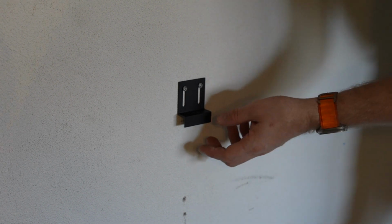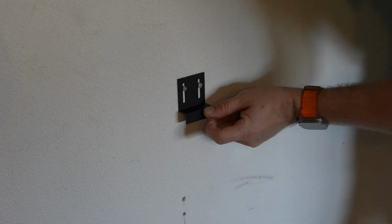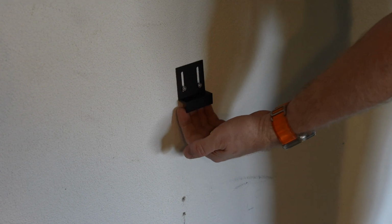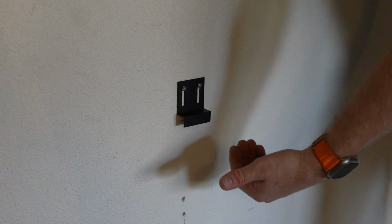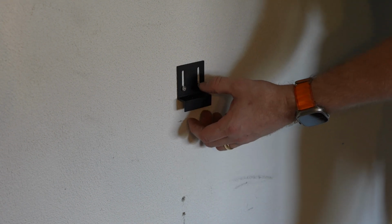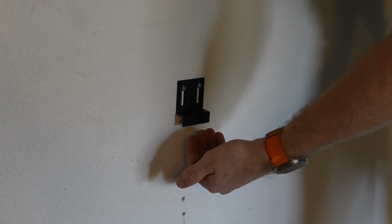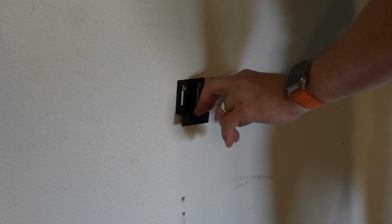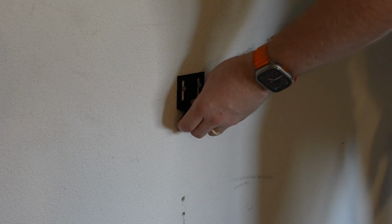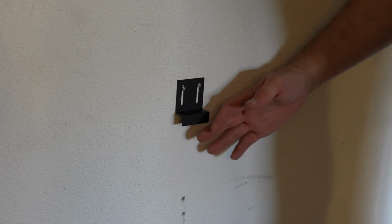Okay, so I just put one in real quick. I measured from my top edge at 47 1/8 down, and that's basically about right there. And then I have a little bit of gap above, so I have more movement. But this is how we want it. We want it to actually float, because what we're going to do is we're going to come in with the screen. We're going to hook the bottom edge first, lift it, hook the top edge, and come back down. And I want these to basically float back down, which means I could loosen this up a little bit more. And then this is going to keep the bottom edge from jumping out, right? Because it's just going to hold by gravity. And then when you have to remove the screen again, you just lift, take the top off, and then bring it back down, take the bottom off, right? So that's what these are. They're not actually weight bearing. They're just to hold the screen against the wall, so it's not doing this.